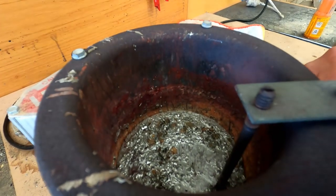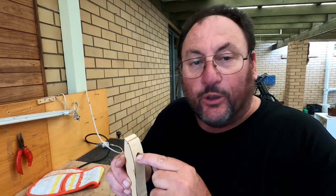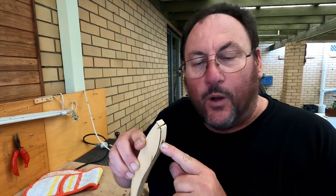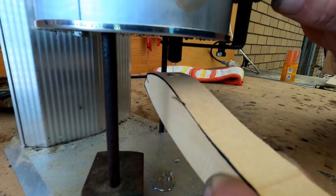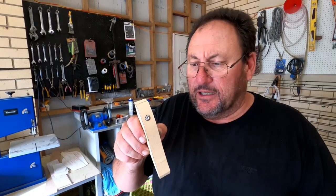Now we're going to fill this hole with lead. I use an electric lead pot, which makes life really easy and lets me do 50 to 100 lures very fast. At home you'll probably use an old-school trick: find a sinker that's the right size and weight for the lure you're using and glue it into the hole — that'll be the weight to help balance your lure. We put some hot lead into the timber, and there you go — already set off and ready for final shaping.